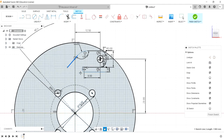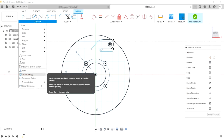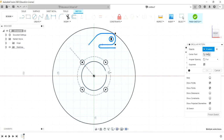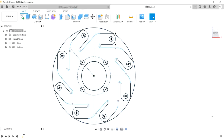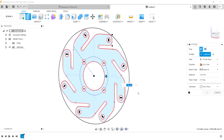Select the lines and add dimensions. Now use circular pattern — create circle, choose the lines, choose the center point, choose the count. We have to do the coincidence constraint and join the two points and the arrow to finish the sketch. Now extrude — do the plane and do a 2mm extrude.